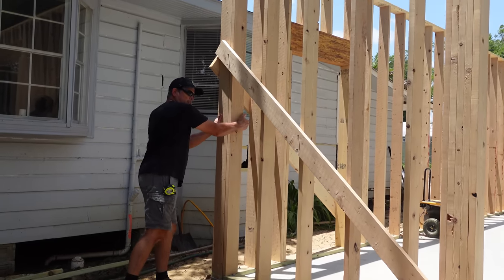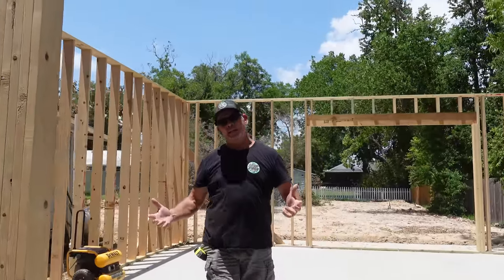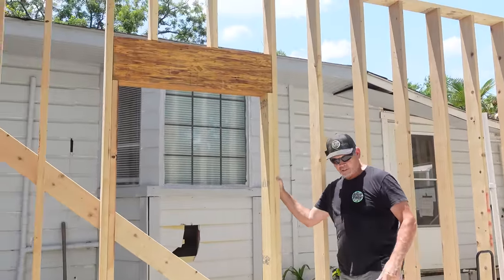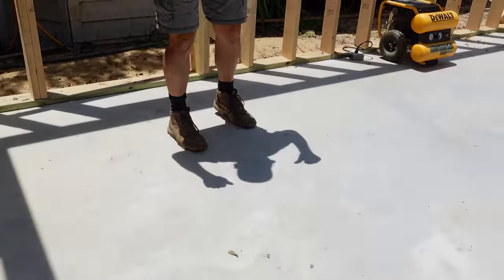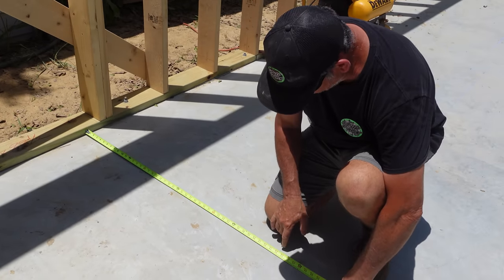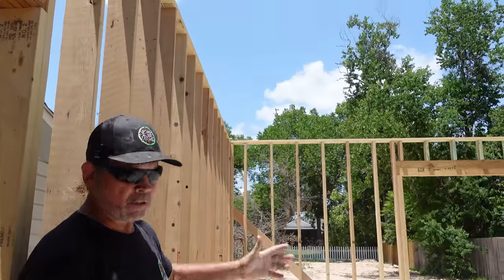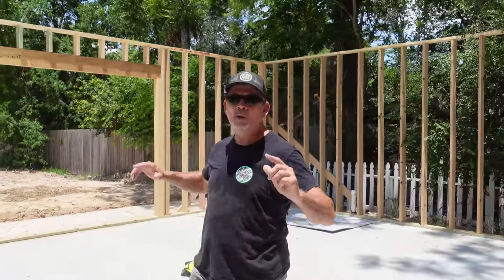It's the next day. Walls are braced really strong now. The goal today is to build our last interior wall — really the only interior wall for the garage space. It's exactly like the front wall except for two key differences: it's 2x4 instead of 2x6, and we don't need a massive header because this is just a partition wall, not load-bearing. The plans call for four foot two from the outside of our exterior wall, giving an interior dimension of about three foot eight and a half for the stairs — really generous. We're going to time-lapse framing this 2x4 wall and stand it up.